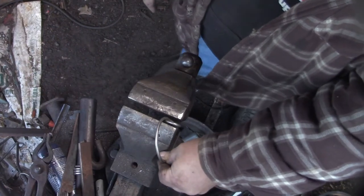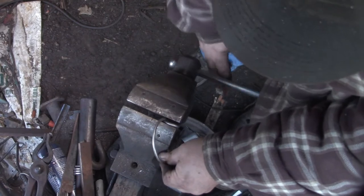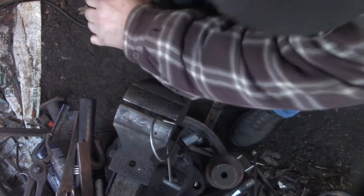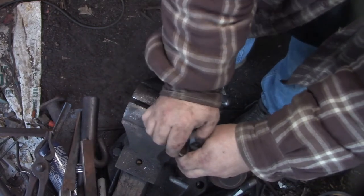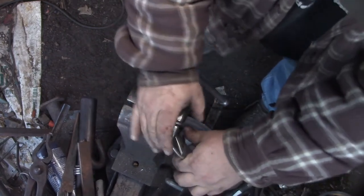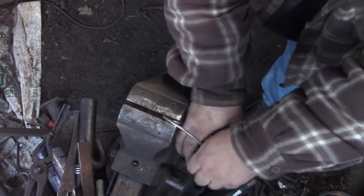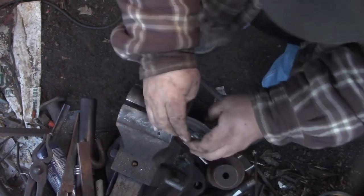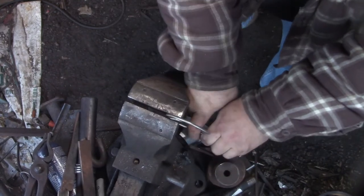Now, I did all of this cold. For one, I wanted to see what I could do to it cold, how to work it, if it didn't work harden too fast. And for the small amount of bending I did, it'll work cold. I mean, I could have put this on the bender. I just...